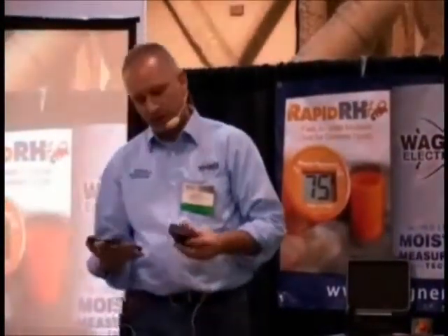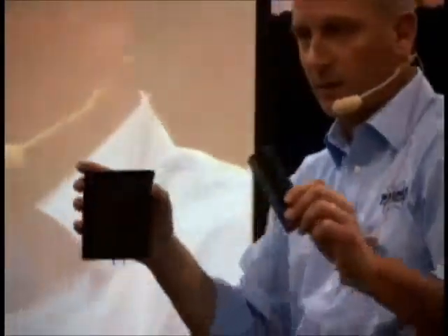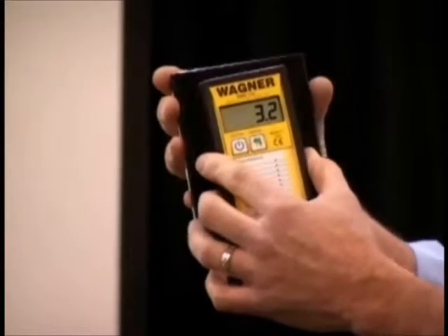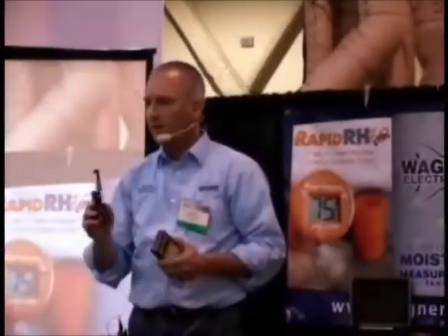I'm going to put the meter on this calibration block. There's a sensor plate on the back side that's a little longer than it is wide, and so is the calibration block. You orient the meter on the block — you'd typically put the block on another surface — make sure it's at the baseline setting for the meter, then look on the back side for information on what that meter should be reading at that setting. If it's within tolerance, it's good to go. That's true with any instrumentation on a job site: before you start, make sure it's stable, calibrated, and ready to go.